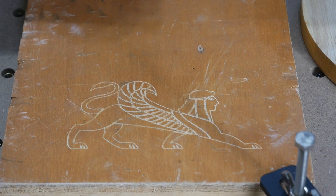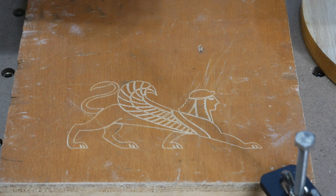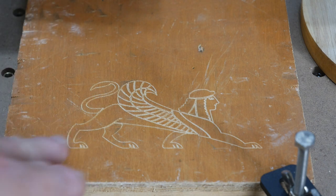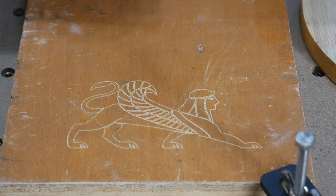The first thing I noticed immediately is that with 12,000 RPM, using a very small bit at about 0.2 millimeter depth into the wood, the detail and clearing is really much better — I don't have a lot of sawdust or junk, and it's cutting the fiber of the wood better. That 12,000 RPM does make a difference, especially on softwood.